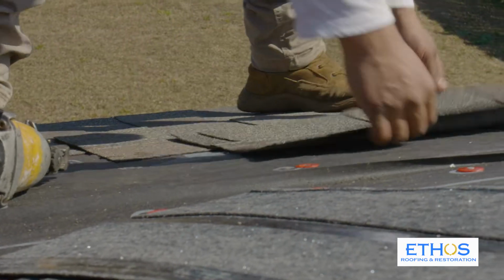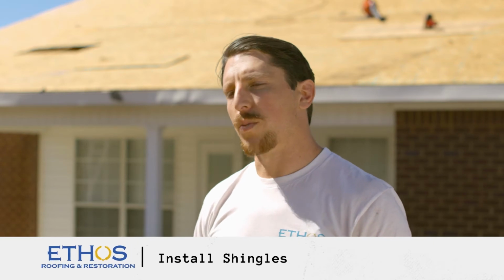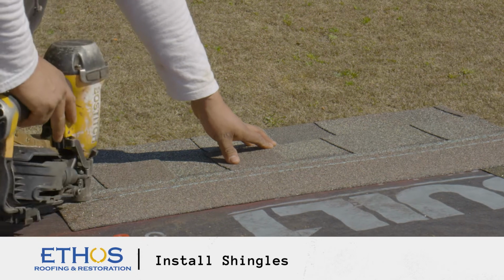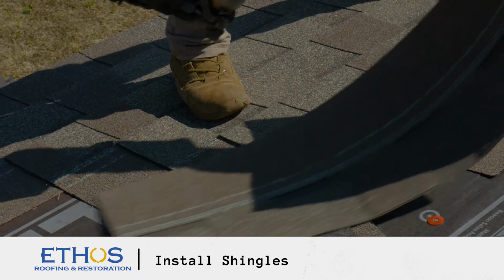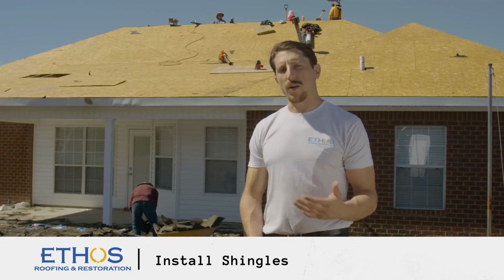The final step is to install the actual shingle to your roof. When installing the shingle, you want to make sure your product adheres to the ASTM Class F and H. This requirement ensures that your roof will meet 130 mph wind rating. When we install the shingles, we use 6 nails per shingle, and this ensures that we meet that recommendation.